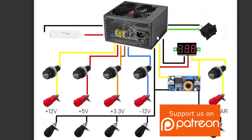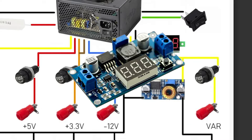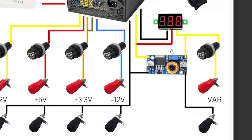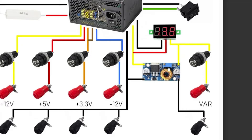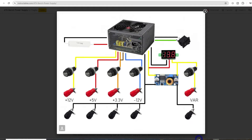What we're looking at doing today is how we're going to turn this portion with a buck converter to make it a variable power supply. It doesn't have — on this picture here you'll see this little blue box on the buck converter — that normally takes a little screwdriver, and that's the potentiometer. I'll show you how I'll remove that and add a new potentiometer that we can put on a fascia plate to control a variable output DC power supply.